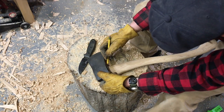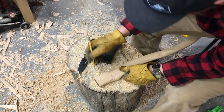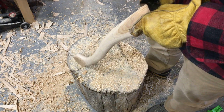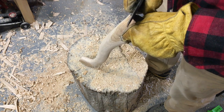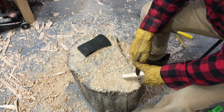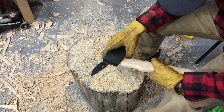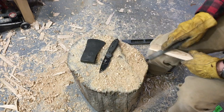Now I'm marking where I want the head so I can start getting an idea of where I need to reshape the top of the handle so that it fits on the head. You can see I'm marking where I need to maybe cut off and shape the handle slightly differently so the axe head fits correctly. I want a nice flat surface on the front where it goes into the front of the eye, so that it goes straight, using a knife and rasp to get the final shape.